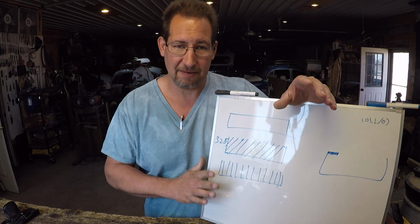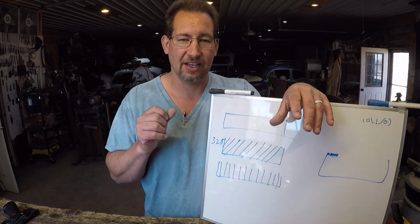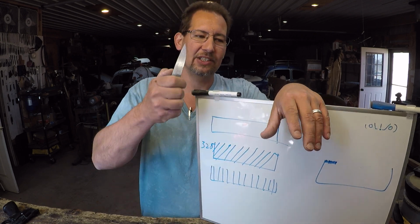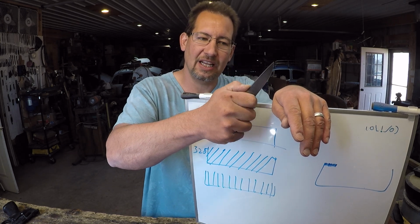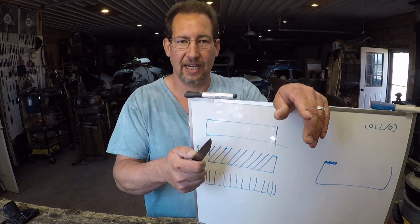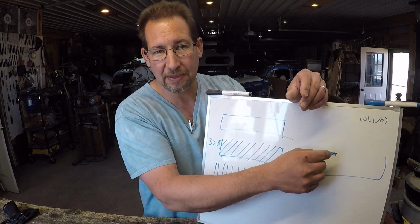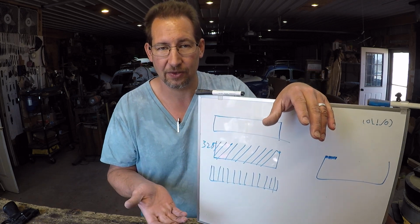You take that same edge and you put it to real work, and it's going to feel really slippery, okay? Pretty much what's going to happen is you're going to put that knife edge on whatever it is you're cutting, and it's almost going to feel like the edge is slipping rather than slicing, okay? And what happens is that those little bitty teeth, there's not enough space in between them to get a bite on the material that you're cutting, okay?